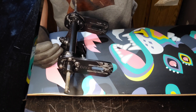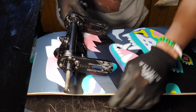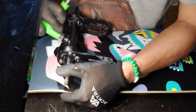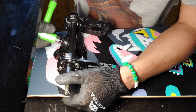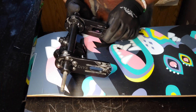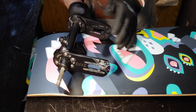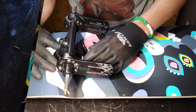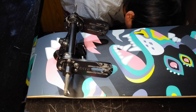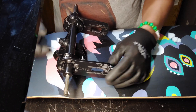You need enough clearance — go ahead and loosen your trucks all the way. When your trucks move while turning, your motor mounts might start grinding, which could be a bad design. I built a board before without thinking about this and was riding when the motor mount started touching. If you've already set everything up, you can use a riser to raise it half an inch or an inch, but try to keep it low.